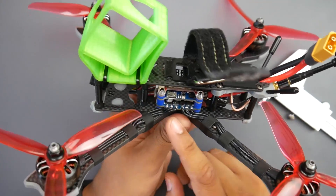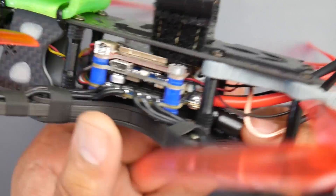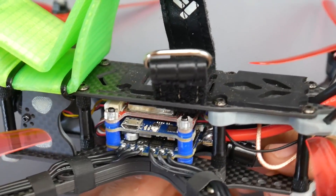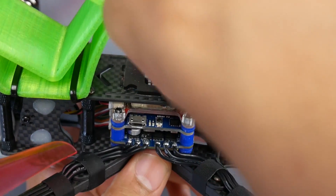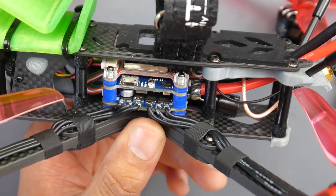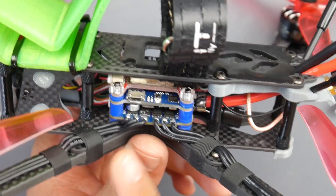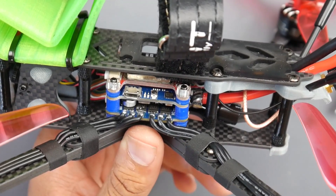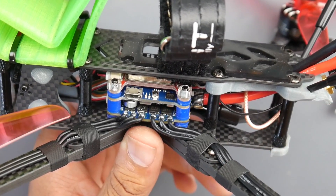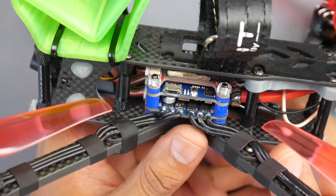On the inside this is their budget 6S ESC, and they've added a low ESR capacitor in the back. I did notice some noise towards the top end of the throttle. After watching the HD video I think it has high D and might need a little more tuning - 6S quadcopters are a bit harder to tune than 4S. But they've done a pretty good job here. The high D flutter didn't show in my FPV feed, only in the HD video, which also explains why my motors were hot at times.